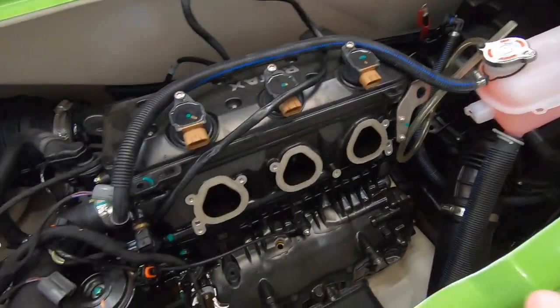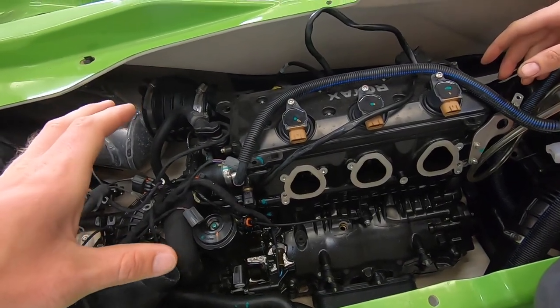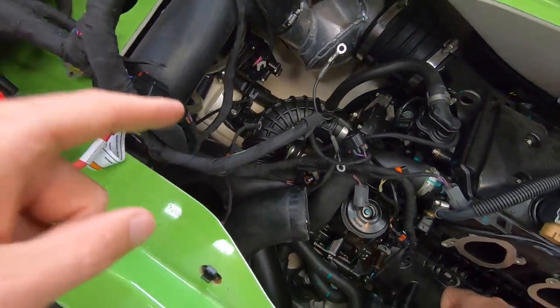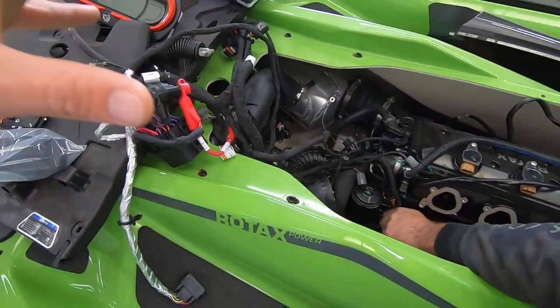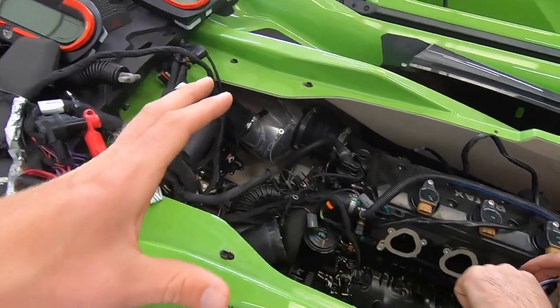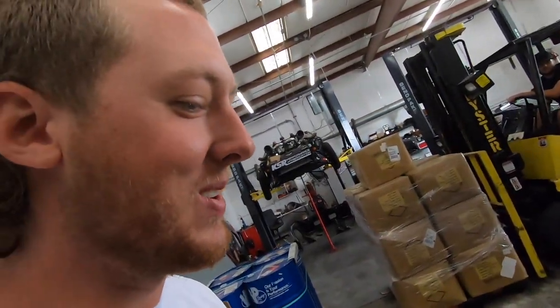Okay, so now, guys, what we're going to be doing is taking that motor mount loose, taking the motor mount back here loose. We got to pick the engine up with the cherry picker, and this is all knowledge from forums and videos that I've watched, so this could be wrong. We're gonna pick the engine up and hopefully go far enough forward that the drive shaft falls out of the crank, because there's this thing that goes over the drive shaft called the carbon seal, and apparently if you damage that, it's gonna leak in the future when we put the jet boat back together. So we have to be very careful while working with the drive shaft. But once the engine's out, that'll clear everything up. We'll pull the pump off the back and start, I guess, getting ready to put it in the boat.